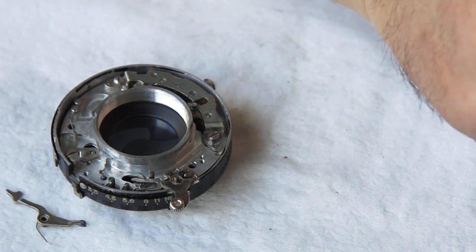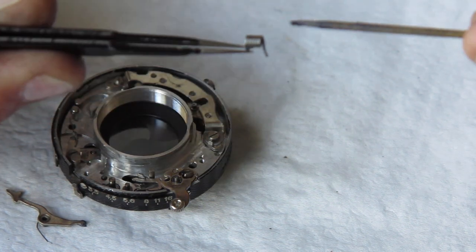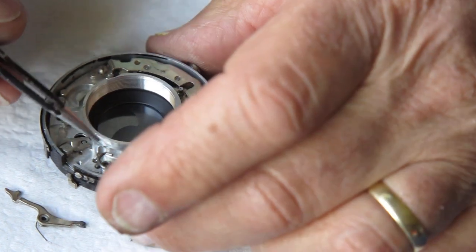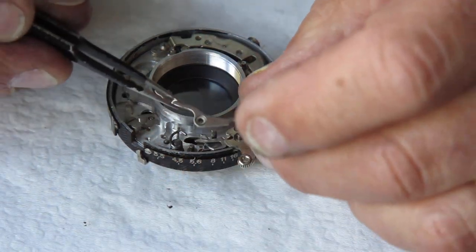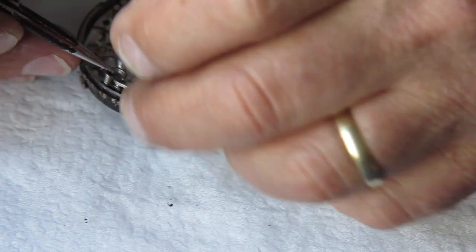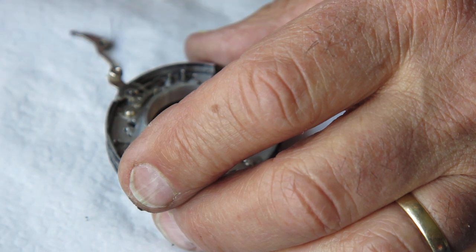Now we also here want a high speed spring. A 500th of a second spring. I'll just put a tiny smear of molybdenum paste under that. That drops in over its post. This piece has to hook under there, onto its pivot, just back where you were.